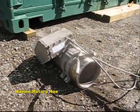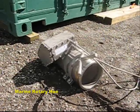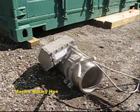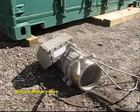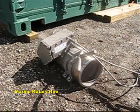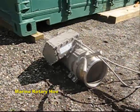The particulars: it has a hydraulic flow requirement of 20 litres a minute, 1500 psi operating pressure. At that operating pressure we've got 30 foot-pounds of rotational torque on the tines at 252 RPM. Total weight of the tool is approximately 23 kilograms.